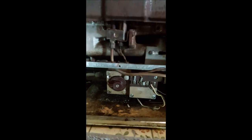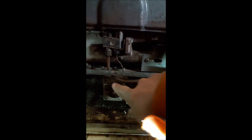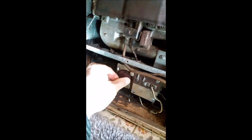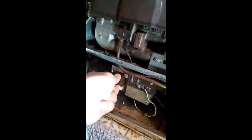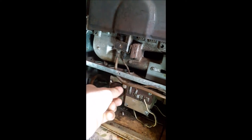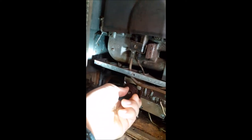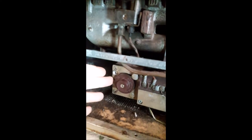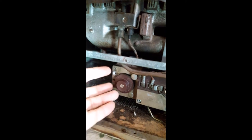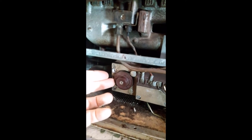I was trying to get the thing lit without any gas coming out. You've got to depress this to get the gas to start flowing. So the right way to do it is turn it to pilot — it has click stops — if you turn it all the way to 'on' there's still no gas flowing, but when you turn it back it'll stop at 'pilot.' The red indicator has stopped at pilot, and I'd have to push it down to turn it back to the off position.